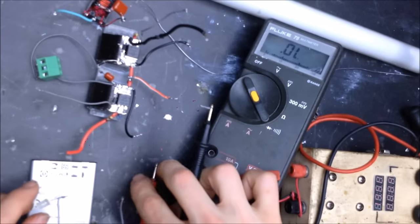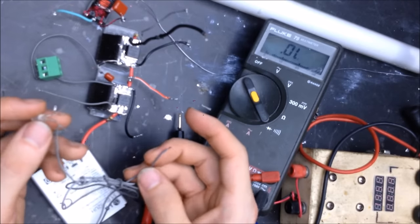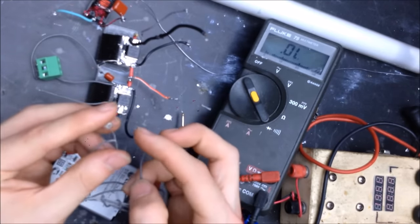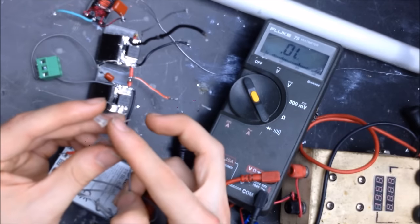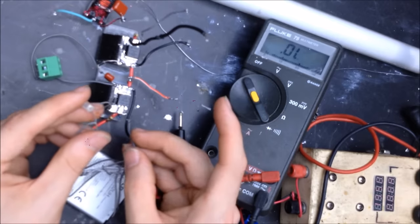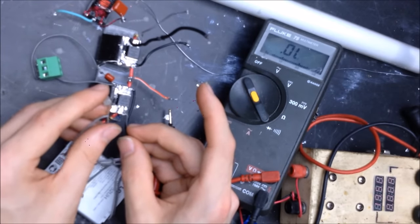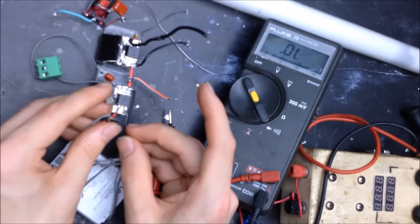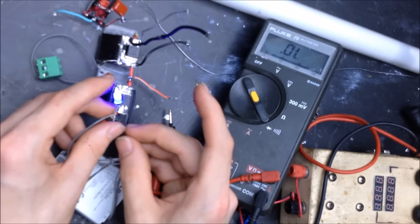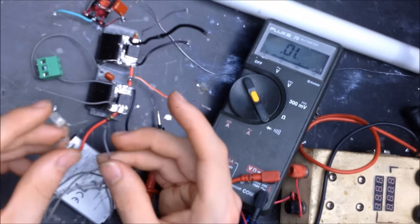As I said, you can also do the same thing with an LED. Here I've got a battery, it's a cell phone battery, and I've got the negative, and the LED connected to the positive, and then the LED negative coming out. So you would see it light up like that. I'm going to touch the source of the MOSFET. I'm going to touch the drain pin, you can see that LED lights up. And on the gate, the LED also lights up.